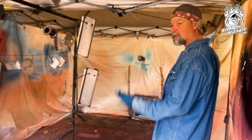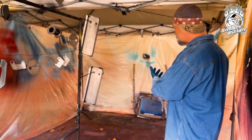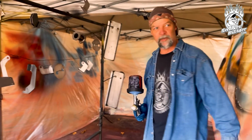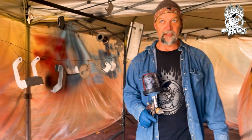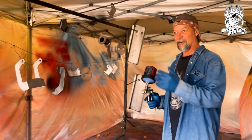The catch here is there is sawdust and there's leaves blowing around and stuff and bugs. And we're just trying to keep something here to keep those bugs from getting in here and sitting on our paint, because they're not going to land here. They're going to land on that damper blade. That's the thing that's the most attractive in this booth to them, is wherever the fresh paint is. And they're going to land right there.